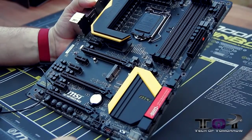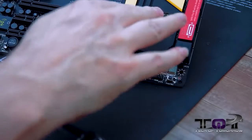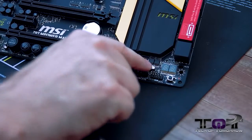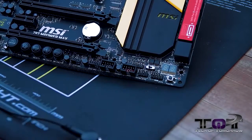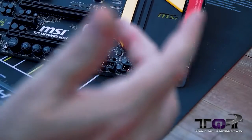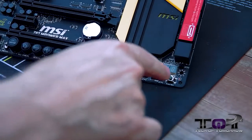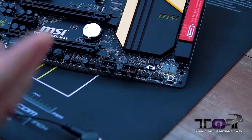So let's keep moving around and go down to the bottom of the board. Down here we have something very interesting — right below the cooling element we have two BIOSes. You can see them right here — they're very small. But underneath that we have the BIOS switch, so you can change between them and select which BIOS you want to use. If one of them gets fried during overclocking, you can switch to the other one so it automatically posts up. Also next to that, we see the POST light LEDs — if you're having a problem with your boot, it'll tell you in a number what is wrong with your system so you can figure it out.